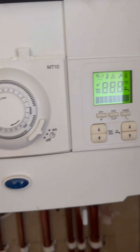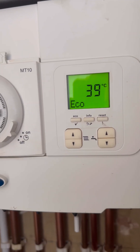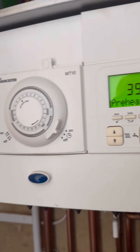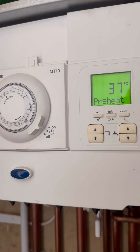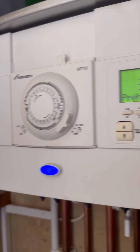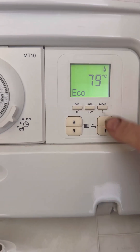Get to the pressure that you want, turn the power back on. Take it off eco by pressing and holding eco — that will turn it into preheat and give the boiler a demand. I personally like letting it circulate through the boiler anyway as it gets most of the air out with the auto air vent inside. Green light means go. That's another one done — happy days.